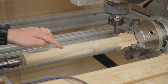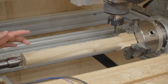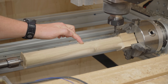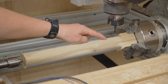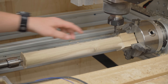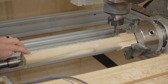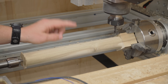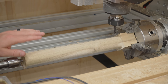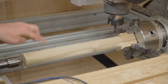Let's do some V-carving to make some points in here. As far as how I'm creating this next toolpath, I'm just using a straight line in V-Carve and using the fluting toolpath. I believe it's going to start on this side and goes down to 100% depth over here, starting at zero going down. I have the depth set to a quarter inch or something like that, but I'm using a 90-degree V-bit. That way, once it's cut, I can glue in a 90-degree square on edge, round that over once again, and we should be left with some actual points.